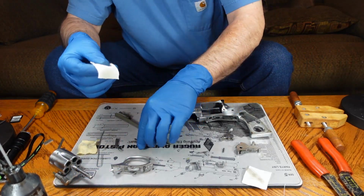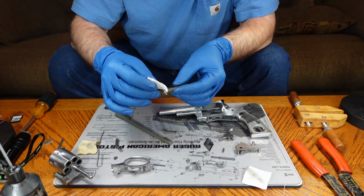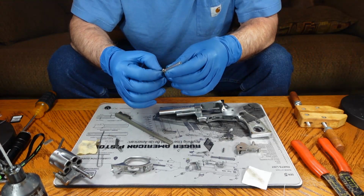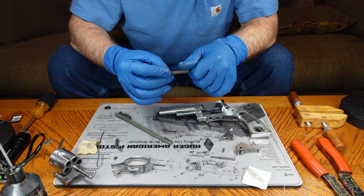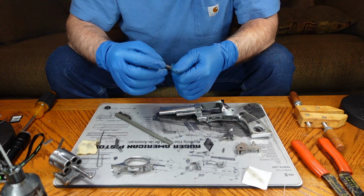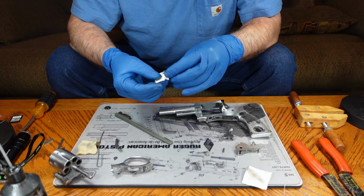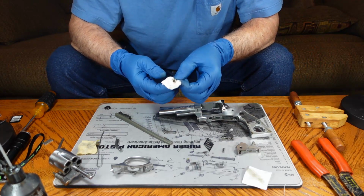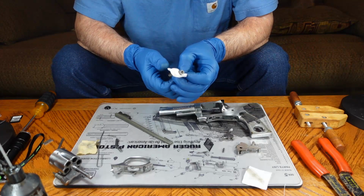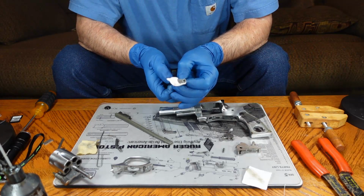We're going to oil this spring exactly the same way as we cleaned it. We're going to take a patch, cover it with oil, slip it through our windings, and pull it together. And this is going to then coat that spring on all sides with oil, which is exactly what we want it to do. It caught on me a little bit, so come here, you. Just being a little bit uncooperative is all. So once we've cranked this all the way through like this, this spring is going to have oil all over it. And that's what we want.